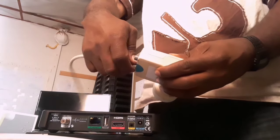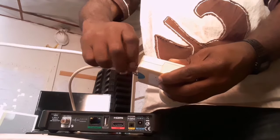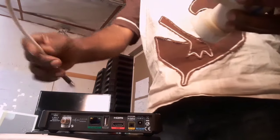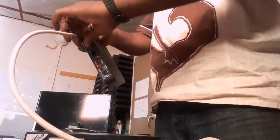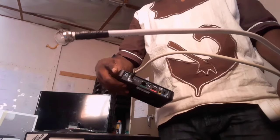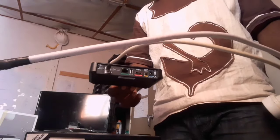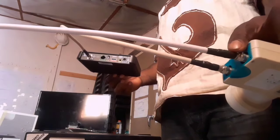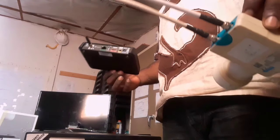So as I'm demonstrating, you take one cable from the dish to your first decoder — it could be this S model type — and you take one cable from the first decoder and the other cable from the second decoder. When you use a smart LNB, you just need one cable to the first decoder and the other cable to the second decoder. That's how you connect two decoders on Extra View using the S model.